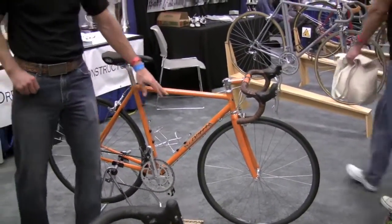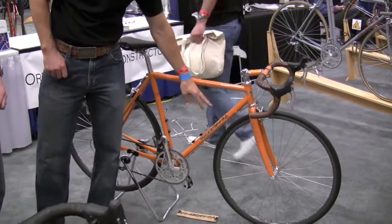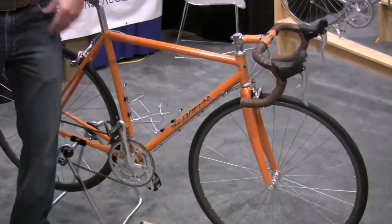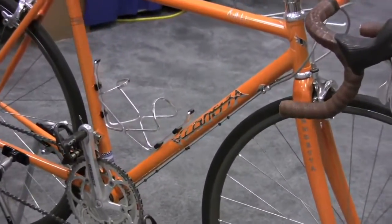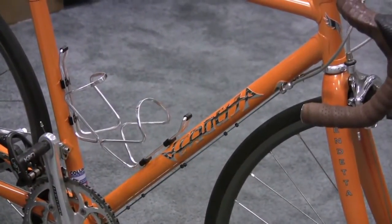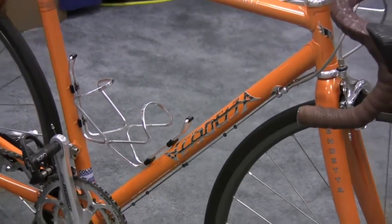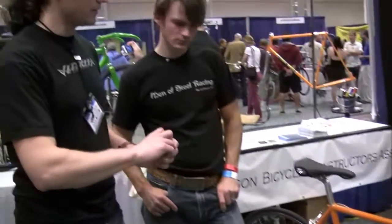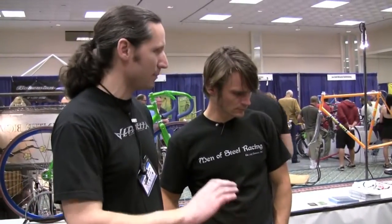I love this — now you had a bike last year, I'm not sure, maybe it was this bike, but the way you have the raised logo on the down tube. That was a different bike — last year we made one for a woman who was a racer, it was a sloping top tube bike. But yeah, the down tube logos are great. It's a stainless steel sheet that we have laser cut, then we silver braze it on there, polish it, and then the painter of course has the joy of masking around it to give us that crisp look.